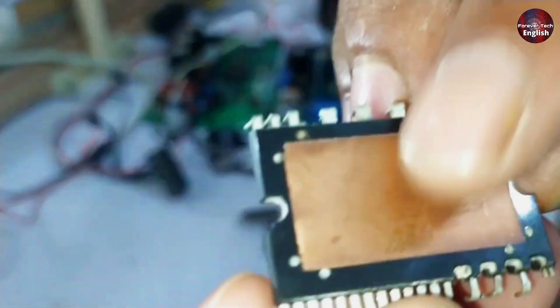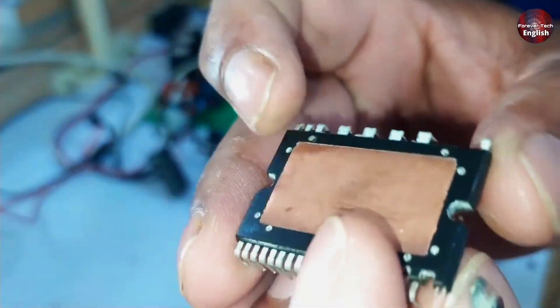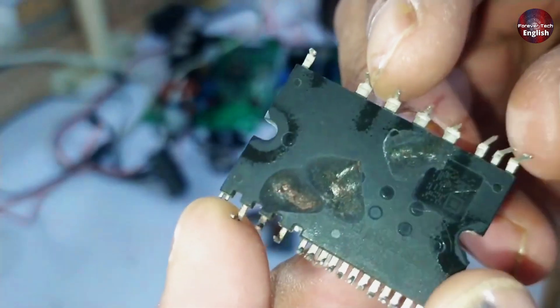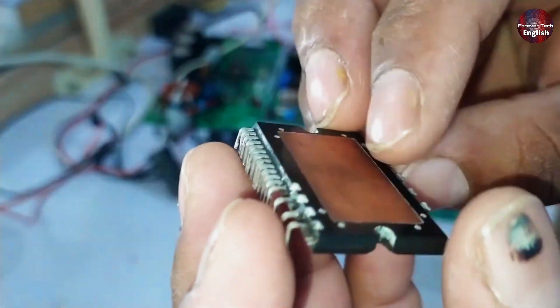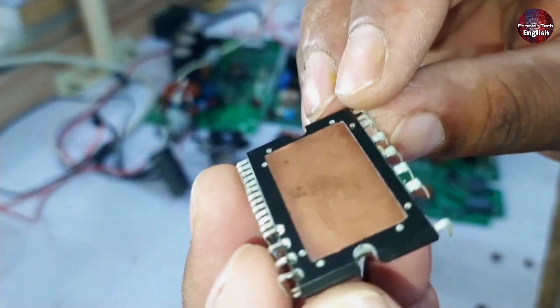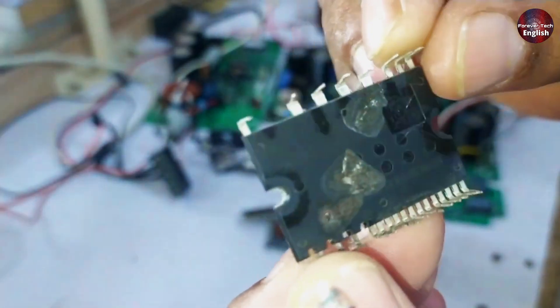I have another IPM for the physical test. At first glance it looks original and new, but that's not the case — it has exploded and is damaged. You can see that it has been blasted from underneath. The way an IPM is designed, it has a heat sink attached to the top, so it can be challenging to judge if the IPM is physically faulty or not.